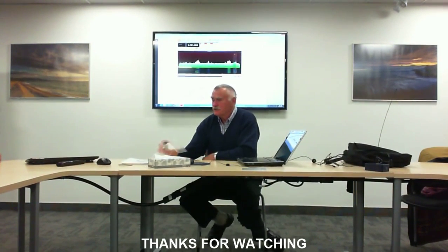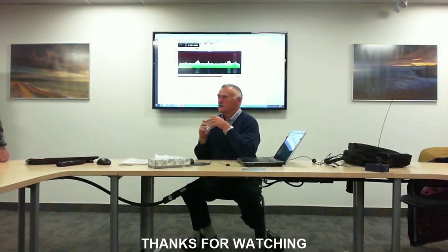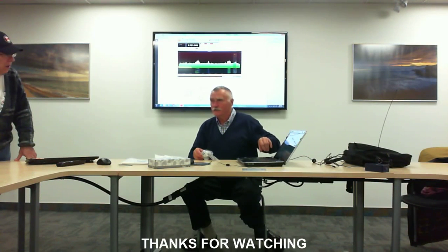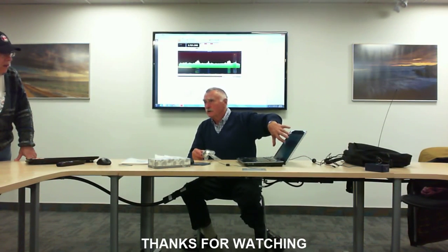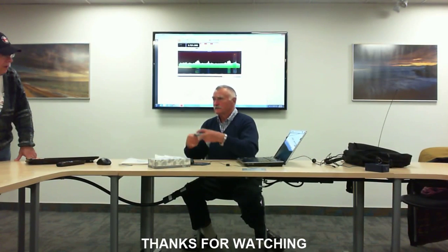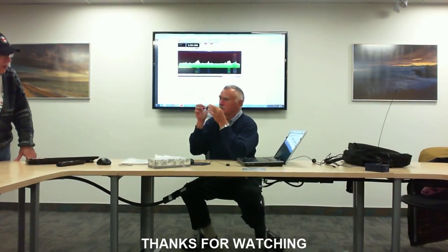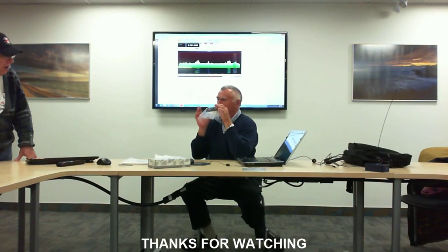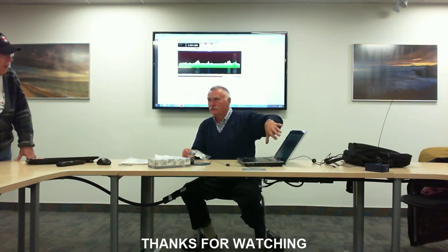This dongle originally is a television receiver, a European standard. If you travel in Europe, you stick this into your computer, run their software, and you see live TV on your laptop. But in North America, we don't have their standard, so a developer wrote the radio software. There's a hardware radio in this: a mixer, a local oscillator, an intermediate frequency amplifier, and an IQ detector. It sends the stream on the USB wire into the computer for digital signal processing.